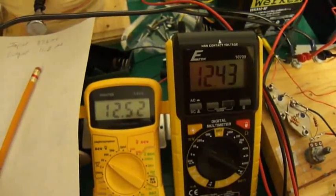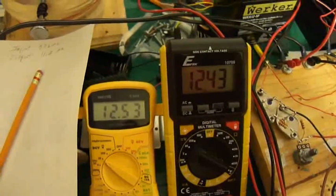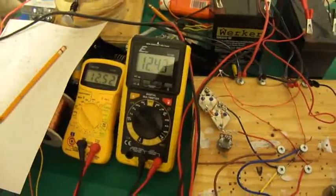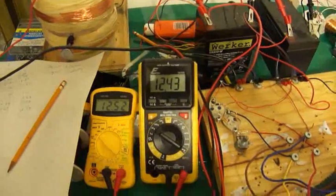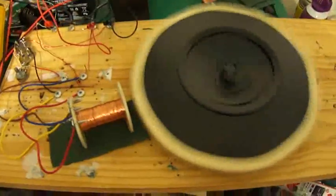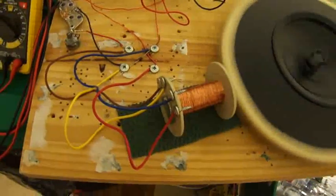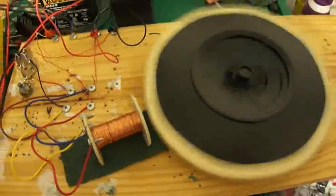I forgot to write down the voltages — I was just trying out the coil — but I know it was at least 12.52 volts, and 12.40 when I started. That's the run battery on the left and the charge battery on the right. It's going up on the charge slowly but surely, and the run battery keeps jumping back and forth between 12.52 and 12.53, which if it stays there all day and all night, I don't care — it's not running my run battery down.